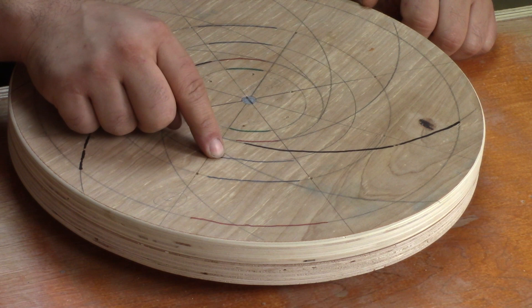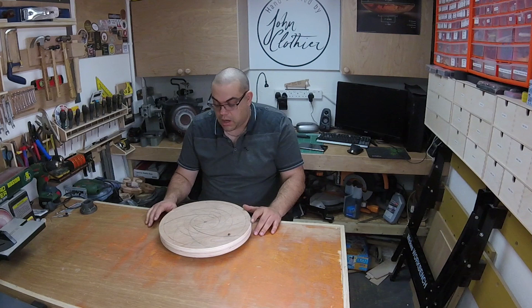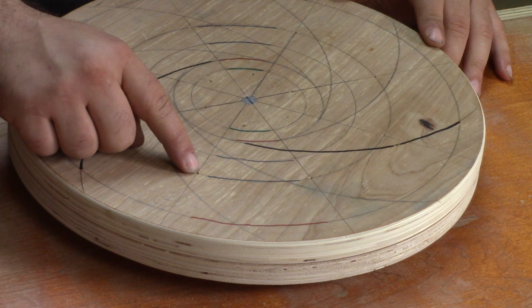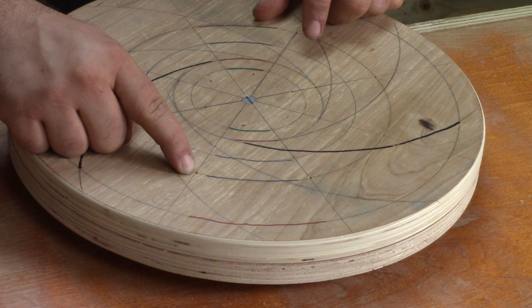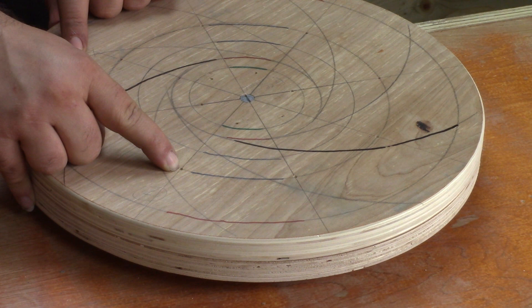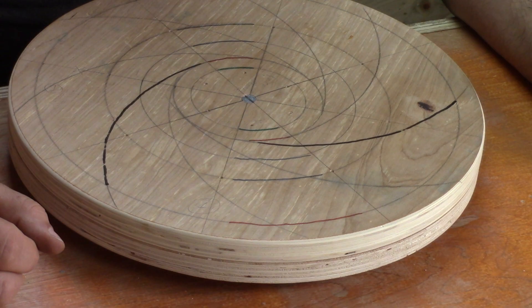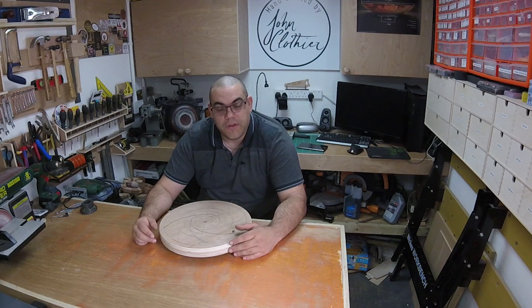Having done that, using a compass, I find my number one line and put the point in this position. Then I measure the distance across and draw my first radius arc there. Then you go around repeating all the way around and you end up with these black lines — these are the slot paths we need to rout. There are other videos; there's a particular one I used as a reference when creating this, and I'll put a link to that in the description below.